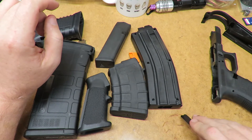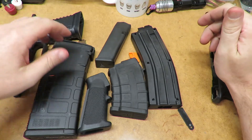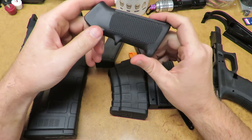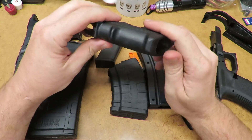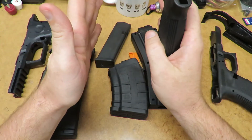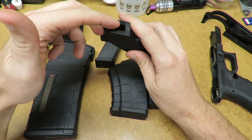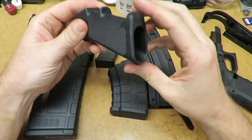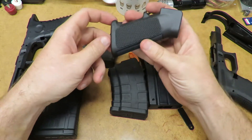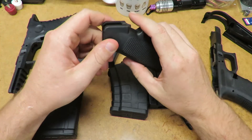Getting into the more detailed molding process for magazines and grips — this grip uses a multi-part mold. You have the main two halves that open and close, but you also have inserts: one that goes into the top and one into the bottom. That's how you get these internal cavities. When the mold opens, the part drops out, they pull the inserts out, put them back in, and toss the part into the bin.